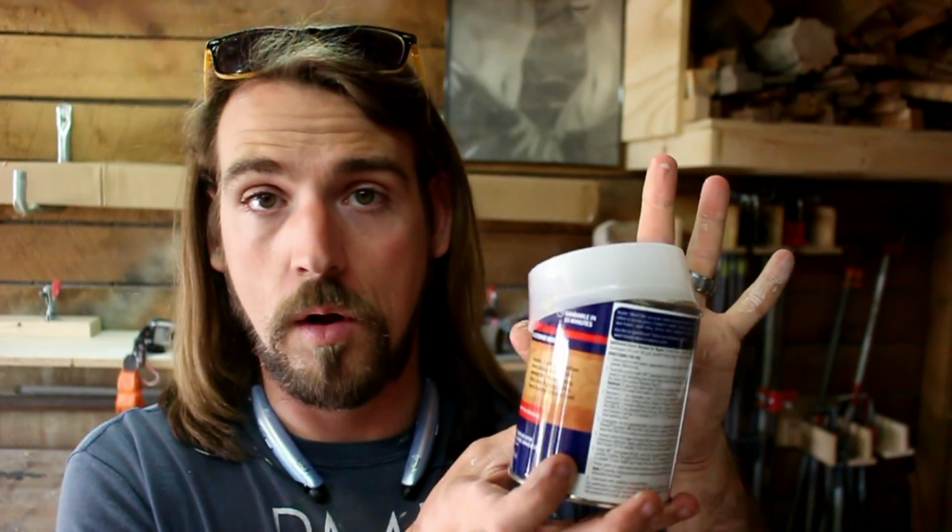So now I'm going to start filling. For most of the holes I'm going to be using this spackling paste. It's Dry Dex with dry time indicator, goes on pink, turns white. It's pretty easy. It also sands extremely easy. I do have one major crack that I'm going to use Bondo wood filler. This is a wood colored Bondo. I don't know how to explain what Bondo is, but when mixed properly, it actually cures within about 10 to 15 minutes, which is nice.